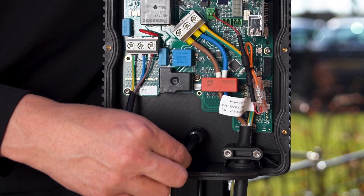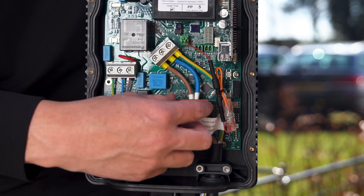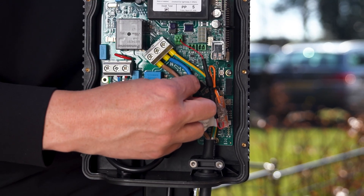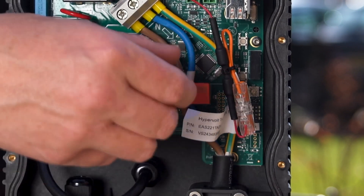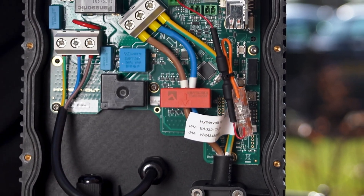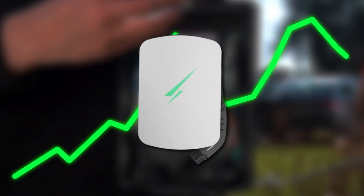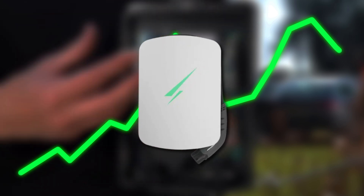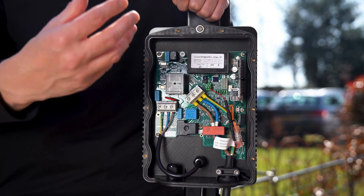So we have our AC lead coming in and that goes into these terminals here. This energy is then measured, processed, and sent back out via this output lead. You also have a CT clamp around the live and neutral going to the car, and the reason for that is to monitor the amount of power being sent to the car. HyperVolt is a dynamic device — if your home load starts to rise because you have the oven on or a hot tub running, HyperVolt will make sure that we don't go over the maximum fuse limit for the property by ramping down the charge rate so you're not going to be blowing any fuses.